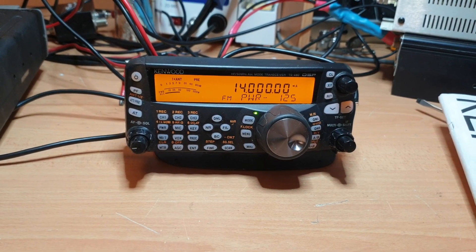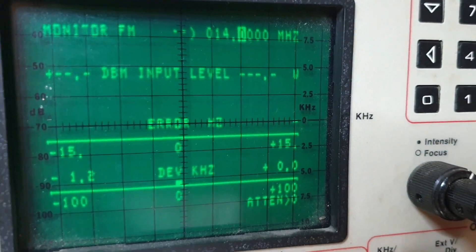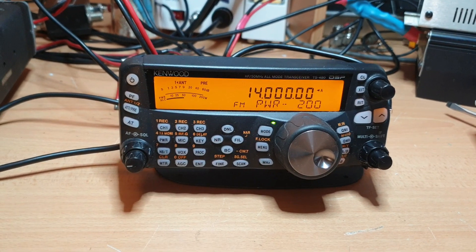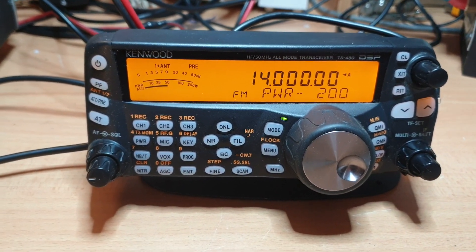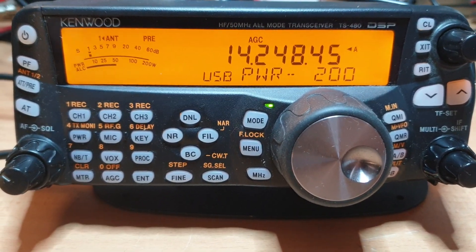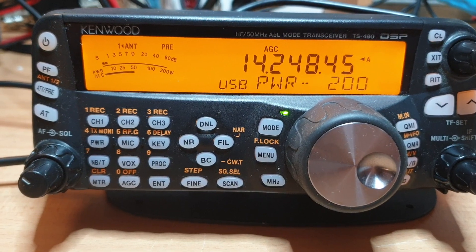Definitely be careful putting these onto a monitor at this level. I can give you a quick burst — see that, 124.9 — you wouldn't want to do that too many times. This is a very sensitive radio and it's nice that it has the box, books, etc. Just trying to think about an antenna. I've had a little scour around 20 meters and there's not much happening. I think we're on a 10-meter vertical, and this radio won't go outside the amateur bands, so past 28.490 there's not much else to test up that end.